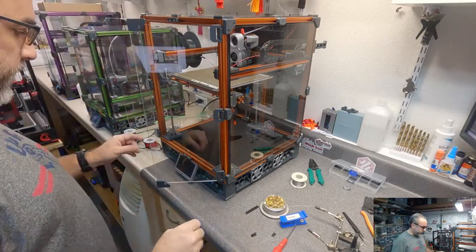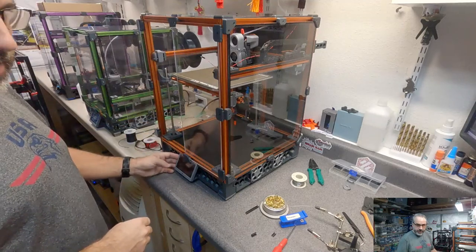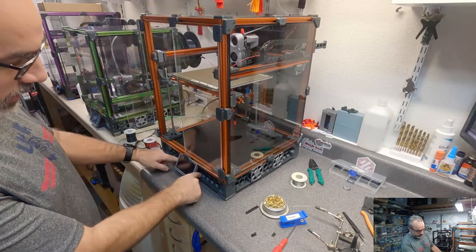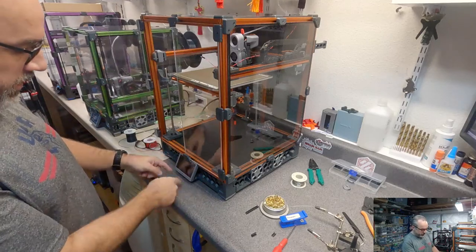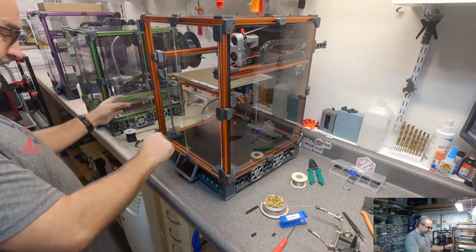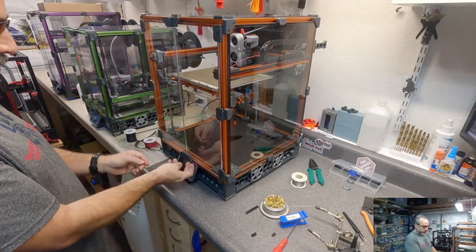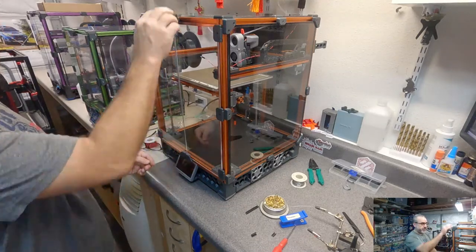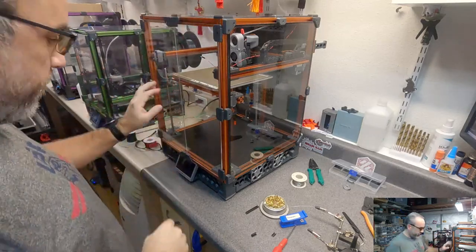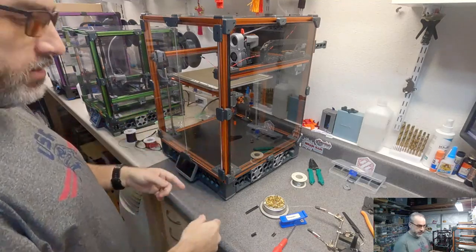Kennedy, I am using a WaveShare 4.3-inch screen with a mount from the user mods community that I did some very minor tweaks on, like closed up some of the hexes and changed the front logo. It works well. The only thing that's a little odd, and you just get used to it, is when you go to open the door, it's very easy to activate the touchscreen, so I tend to grab at the top all the time. But I'm running this with Klipper screen.